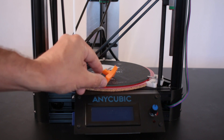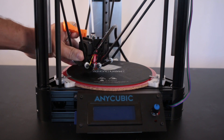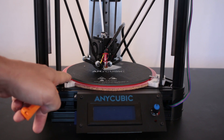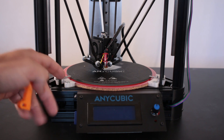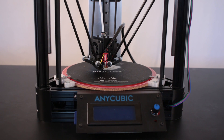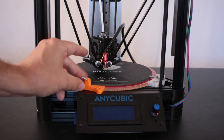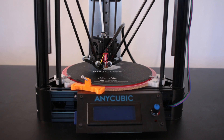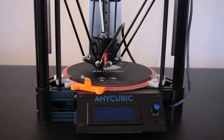With this lower design you won't get that collision anymore. The design that's currently on there has these metal tabs and those are a pain to make. This is really low profile so maybe you could consider it the better design, but it's really not worth the effort to make those tabs — this will do just fine. So I redrew that and hopefully anybody else who wants to go through these modifications has a nice working bracket.